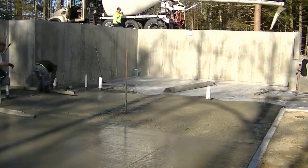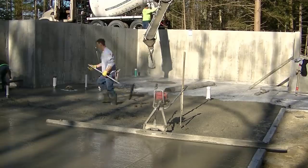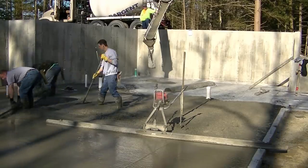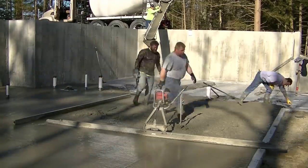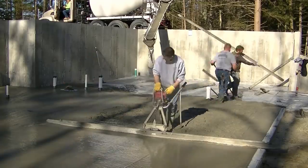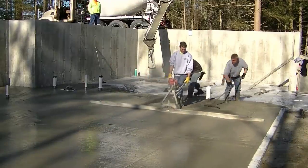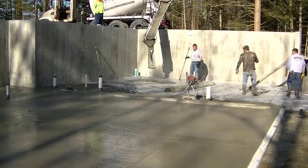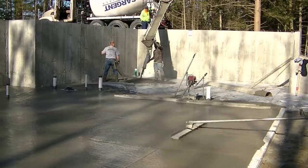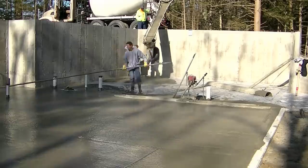Around those pipes we don't usually use the vibra screed — we'll use a smaller hand screed and shoot a lot of wet pads to make sure everything stays nice and flat and level. We keep the vibra screed for the wide open areas. When someone has plumbing in a basement like this they're probably going to finish it off. We call this a daylight basement or a walkout basement — where the concrete wall is at ground level. It basically doubles the square footage of the house, which is pretty cool. It all depends on how your land slopes.